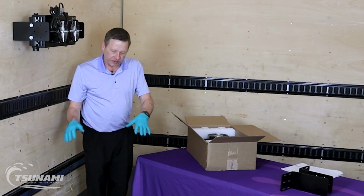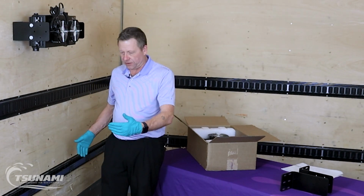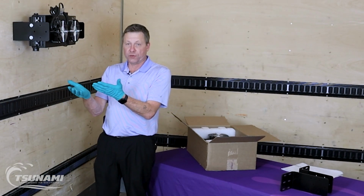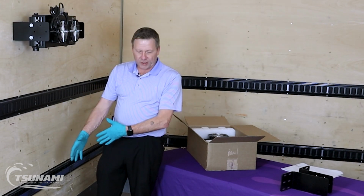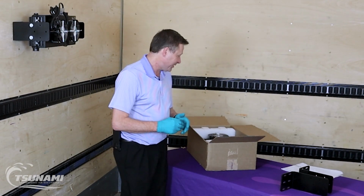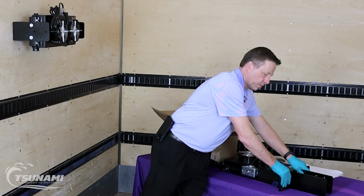Typical Aftercoolers either come mounted on a stand, or they're going to come with feet that allow you to have them vertical or horizontal. A lot of times they're going to have it lower to the floor, so that cooler air is able to be drawn through that heat exchanger with the fans, which is great. Except when you start utilizing floor space in a mobile application, it really takes away from what you're trying to accomplish, which is a mobile application. And it will come with the mounting hardware as well to affix the Aftercooler to the bracket.